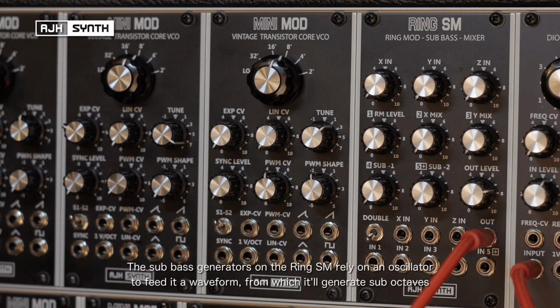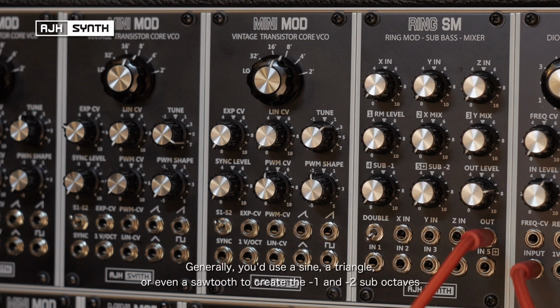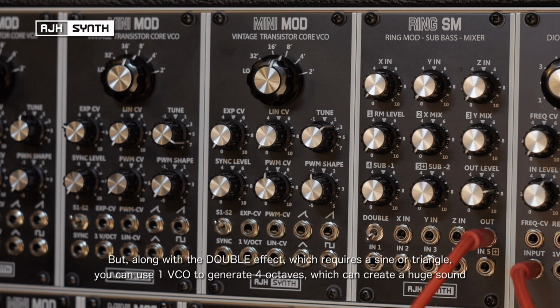The sub-bass generators on the Ring SM rely on an oscillator to feed it a waveform from which it will generate the sub-octaves. And generally speaking, you'd use a sine or a triangle wave or even a sawtooth just for the minus one and minus two sub-octaves. But along with the double effects, which requires either a sine wave or a triangle wave specifically, you can basically use one VCO to generate four octaves in total,